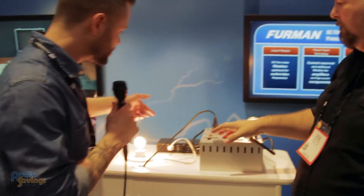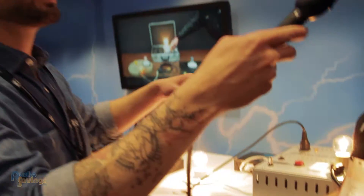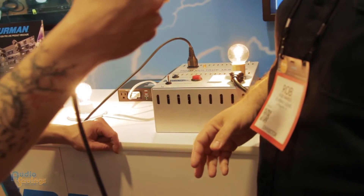Does this also act as a power conditioner? It says right there: power conditioner. Absolutely. So it also does surge suppression. Surges are fast spikes — 3,000 amp, 6,000 volt. We can dissipate up to 3,000 amp, 6,000 volt, as fast as a nanosecond, and take care of that energy. With the S&P technology, it doesn't compromise the surge suppression — so it doesn't go boom. A lot of stuff smokes, like that thing over there. Our stuff handles 3,000 amp, 6,000 volt hits fast as a nanosecond. Anything over 137 volts for a third of a second disconnects so it doesn't cook.